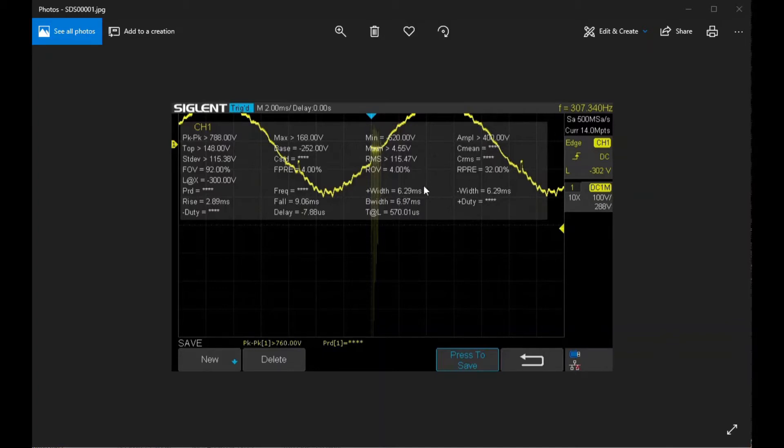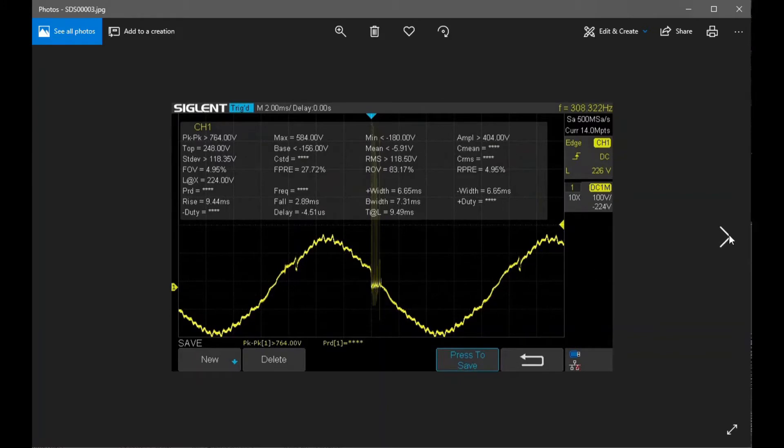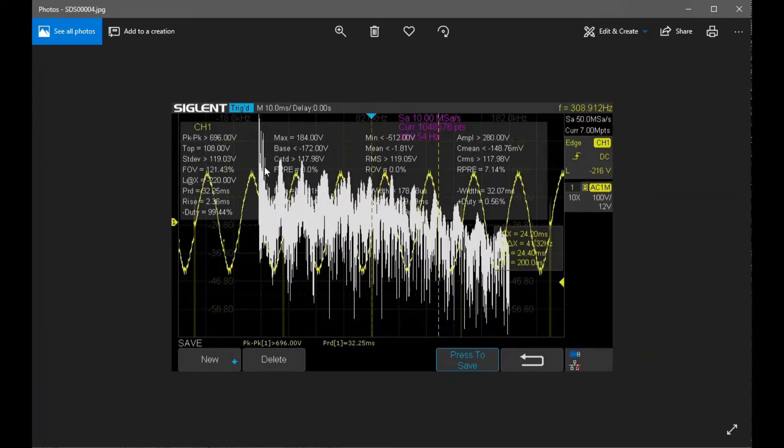Again, with the scope set up properly on 10x, notice our peak-to-peak volts before doing anything was 788 volts. RMS is 115 — a little low but not crazy low — but the frequency is 307 Hz; it should be about 61–62 Hz. And obviously you can see our peak-to-peak crossing the x-axis right here. That's the FFT function you can use to measure total harmonic distortion — less than 5% for electronics. The scope isn't really meant to capture power harmonics, but you can see there are harmonics here, here, here, here, here, here, here, and here — maybe another one there. A lot of noise in this generator.